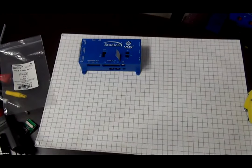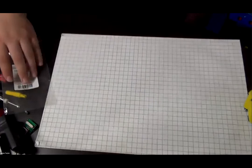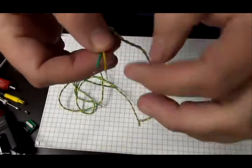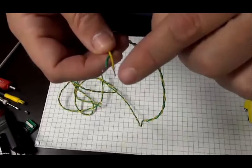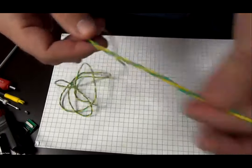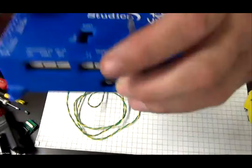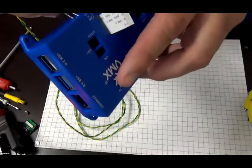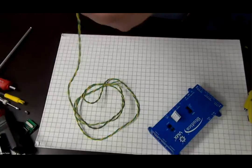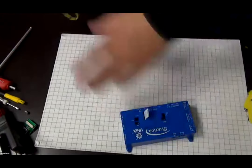Now, just one point about the CAN cable that I'll talk about, because we talked about wire preparation in my very, very last slide yesterday. But you'll notice that it is kind of long, and on the stripped ends, when they're clean, they've been stripped. And then there's a bit of solder on them, okay, so that they do not fray. So if you do cut that shorter, I suggest that you do the same thing, because then when you go to put that through and put it into those connectors, okay, for the CAN, you're not going to get any fraying wires or any short on there, okay? So just a quick little tip and trick on doing your wiring to make sure that everything's okay.